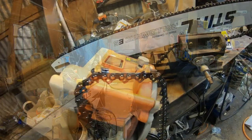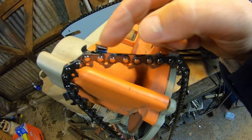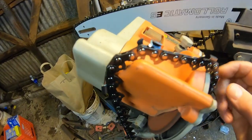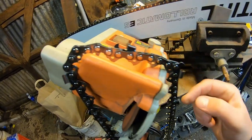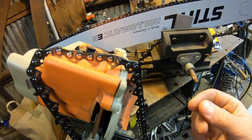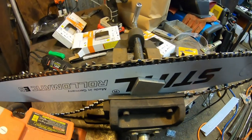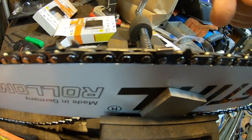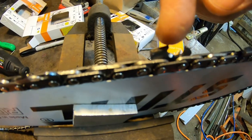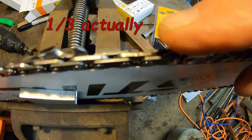There are going to be more clearing teeth and fewer cutting teeth. Here you can see a cutting tooth at 30 degrees, then a skip, then another 30-degree cutting tooth, and your depth limiters. We're going to take out two, leave two, take out two, leave two — cutting them off with a Dremel tool. Here's a blade I just completed: two good teeth, then one I've taken out, and you can see it's about half the width of a standard cutting tooth.